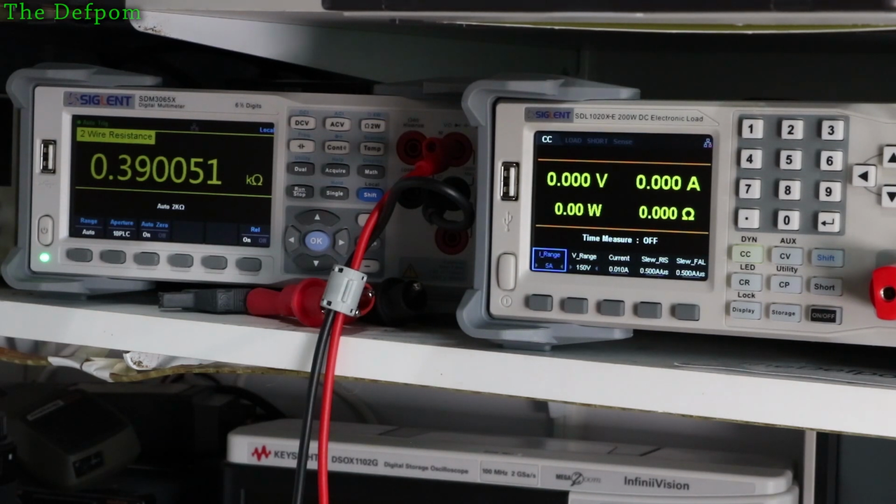I mean, it gives you a pretty reasonable representation of resistance. Obviously it's putting like a MOSFET or something in there, which is then used to change the resistance. So I'm changing by 1 ohm at a time here as well. Alright, so if I change the range back down, so it's 7 ohms I've got it set to right now, 4 ohms. So any resistance I want in that range between 0 and 399 ohms I can set. Kind of goes to 15, so it's fairly close. That's not bad, is it?